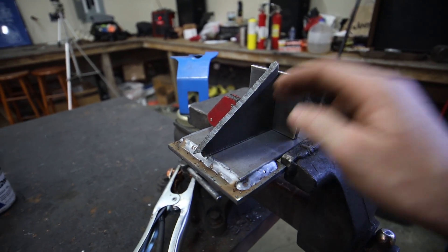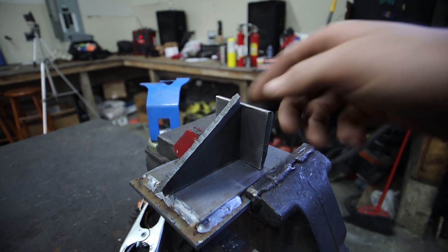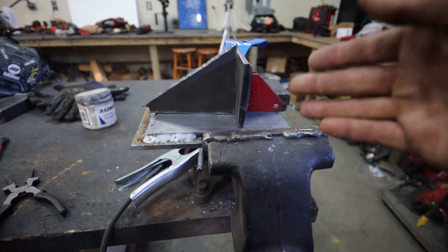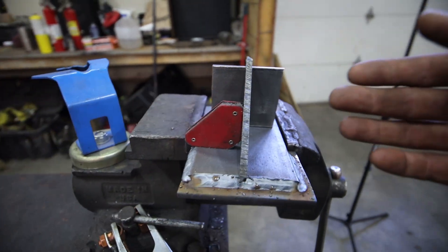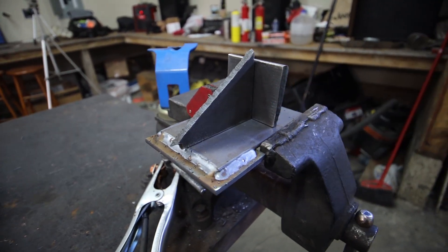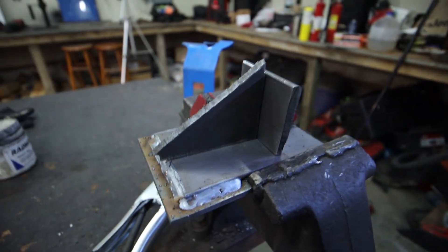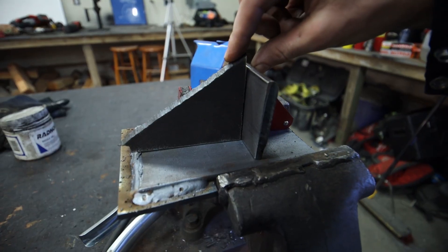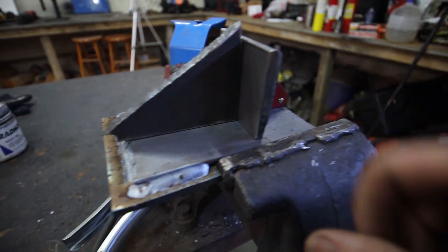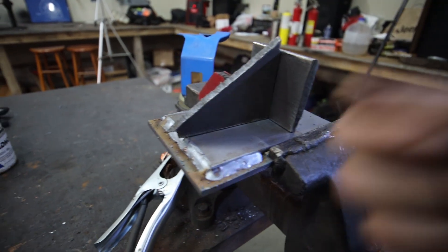Once you've got a good feel for your welder and you've stacked a bunch of plates together, now you need to weld from different positions — this is where you're going to actually increase your welding skills the most. This one isn't too bad because gravity is just kind of holding it down. On the vertical, the weld can get away from you. I would try welding it down and also try welding it up. Sometimes you're going to be welding on a vehicle where you won't have the easiest reach, so welding in different positions on a small controlled scale is going to help build up those different skills. The magnets are just there to help us put some tacks on. I like to put a tack at the top right here because whenever it shrinks it has a hard time pulling up, then put one here, and then a couple more — two or three really fat tacks — and then it should hold in place. Pull the magnets and do your welds.